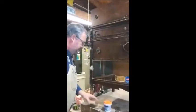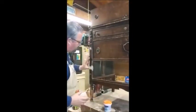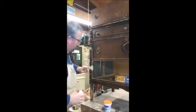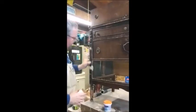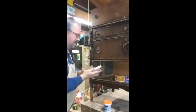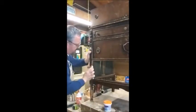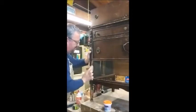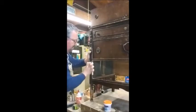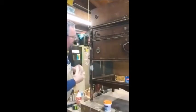I'm back. We're looking at the front of our dresser and we're going to sand this out now. It's dry — the color is now beige, a light tan, compared to the pink. I'm using a wood block with 150-grit medium sandpaper. The block keeps it flat, especially on flat surfaces. I'm gently sanding this out on both sides.